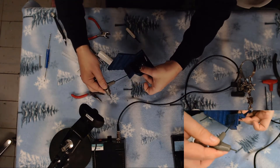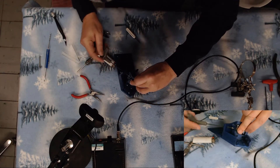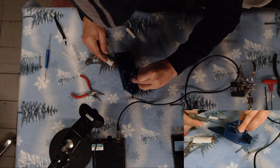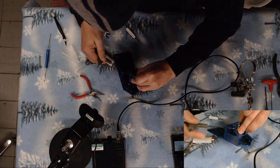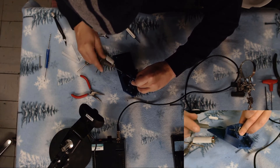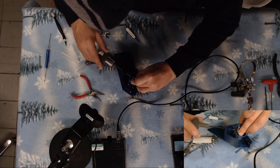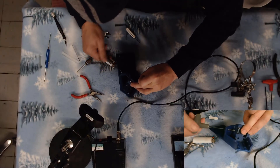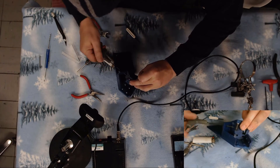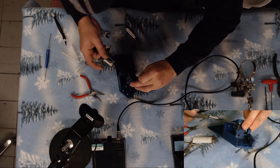As you can see, I made that whole opening oblong so that you can slide your wrench in from the back to get to the second screw for the micro switch. There we go. Be careful not to tighten these too tight — remember that is just plastic thread.